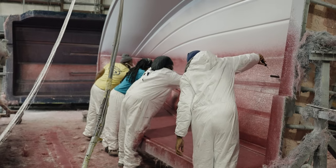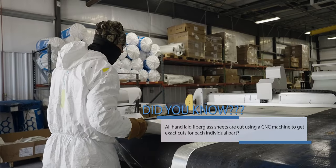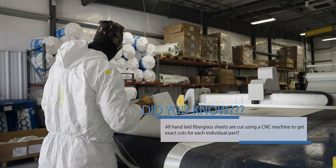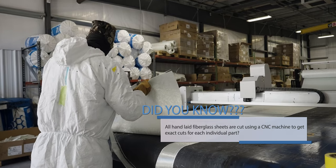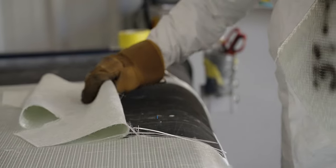The primary advantage of using this method is that the pre-cut sheets of fiberglass are engineered to have a very specific thickness. This allows the builder to have very consistent laminate and ensures an even amount of fiberglass. At the surface, this method certainly delivers, but let's talk about one major disadvantage.